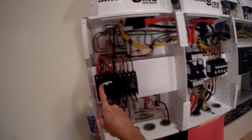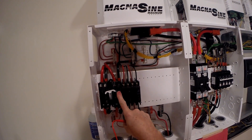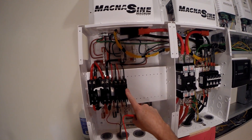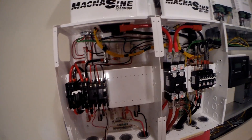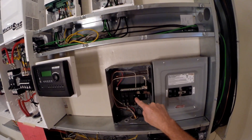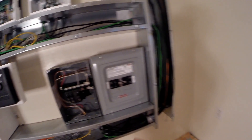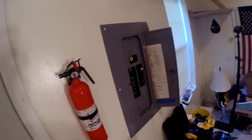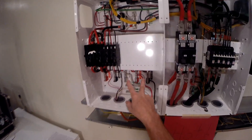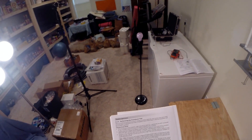Over here we've got the AC side. This is the AC bypass — it takes input from the utility and puts it right back out, bypassing the complete system. This is the AC output of the system whether it's bypassing or inverting. These are the two AC inputs to the inverters — if you had AC input it could be charging the batteries or running the loads. We've got the RTR controller and the two chargers up here. This is the output panel with a 20-amp breaker just for testing. This is the transfer switch and the utility power with a 60-amp breaker. So 60 amps comes in to the transfer switch on utility, that pumps 240-volt AC into the input which goes into the two inverters, or is bypassed out.